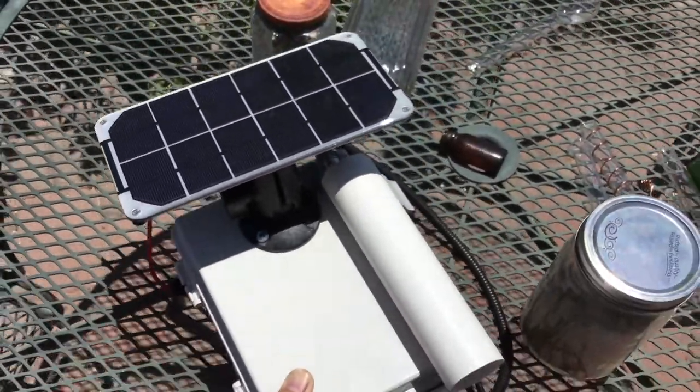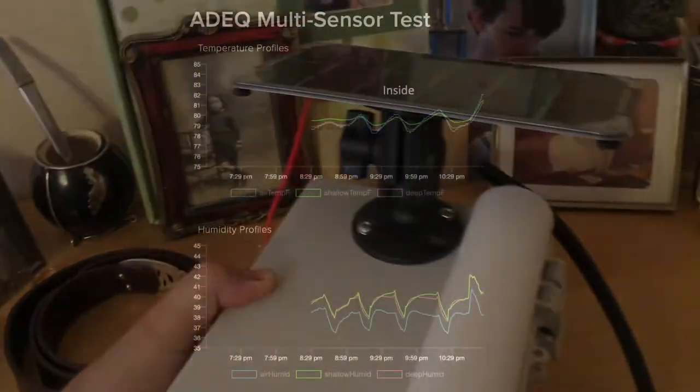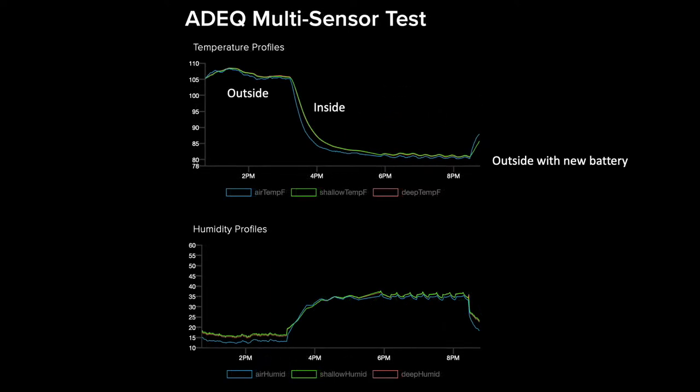One of my first tests involved leaving the box outdoors in the sun for a few hours, then moving indoors to my workshop in the garage, where I cool things off with positive pressure from a swamp cooler. The two gray lines show when I turned the swamp cooler on and off, resulting in temperature dropping and humidity rising. I then placed it in my home, and you can see AC cycling on and off resulting in impacts on temperature and humidity, as recorded by all three sensors responding accordingly. Migrating the box outside and back inside again, all sensors reported fairly close to one another, giving me confidence that the code and wiring are robust for field installation.